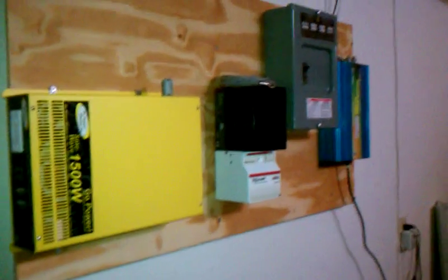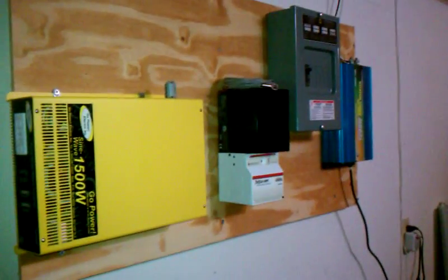The idea of this system is to actually live off this power. I'm going to create a battery stand right here — batteries will come right about here — so my two gauge wire will literally be probably less than a foot long, meaning little to no loss. I'm going to install two distribution blocks, one here and one here, and run the negative and positive into both units, keeping all runs really short to avoid loss.